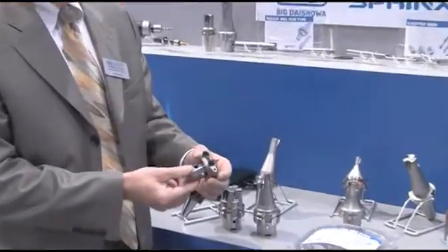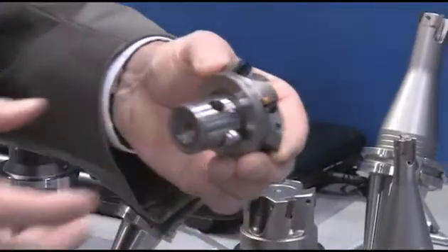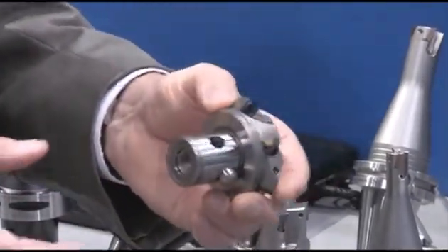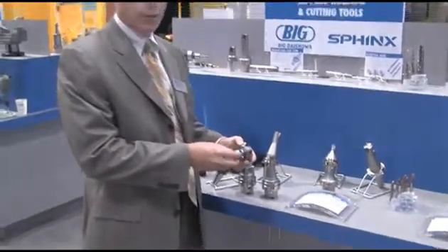Available in connection sizes KA1, KA3, and KA4, we can combine this with our modular tooling system to adapt to a variety of different tool shank lengths and access lengths, to get into very critical defined areas that need chamfering operations performed inside.